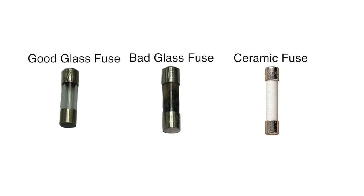You can also have a ceramic fuse on your power supply board. The ceramic fuse does not visually show if it is good or bad — a ceramic fuse may have a colored stripe down the center of it. A ceramic fuse will always have to be tested with a meter to determine if it is good or bad.